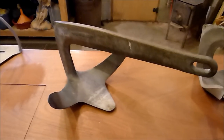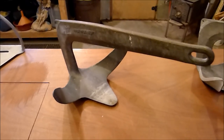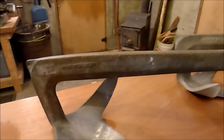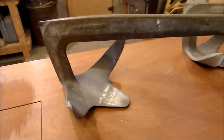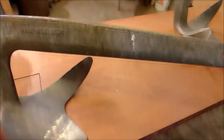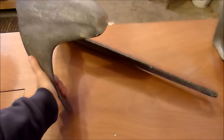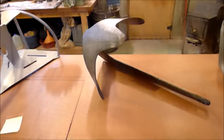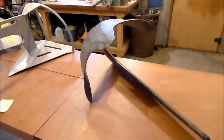Next, this 44-pound Bruce anchor actually weighed out at 44 pounds on my scale. The tip came out at 14 pounds — 32% of total weight. The way these set when not upright is a little different than the others — they start off almost upside down. This is actually not likely; most of my testing showed these things landed pretty much upright. You get quite a bit of weight on the tip, and they do indeed set quickly.